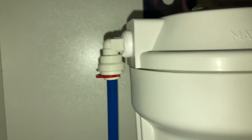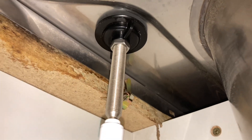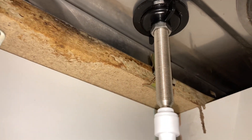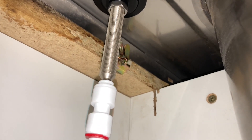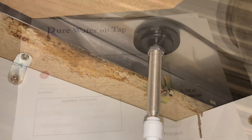I've got the red clips in place — one there, one there, one there, and one on the bottom. Looks like I'm one short for the top one, which clips directly under the tap as well. You can see a bit of water's been getting down there — whoever did the dodgy kitchen, bodgie installation with no silicone. The clamp behind it wasn't even installed; I just fixed that up. I might have to pull the whole sink out and put some silicone on there — not good.